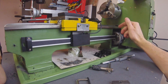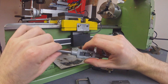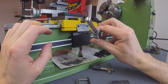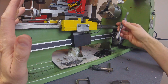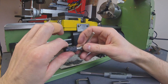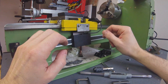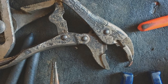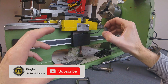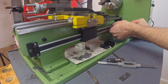The holes are now drilled and tapped for the scale ends. I didn't show the tapping because I had a bit of an issue - the standard tap wrench couldn't get enough spin due to too much stuff in the way, and the T-bar tap wrench just kept spinning with no purchase on the tap. In the end I had to revert to something quite barbaric, but it worked. I've also cut a couple of shims for the scale ends to bring the scale out partially from the bed.